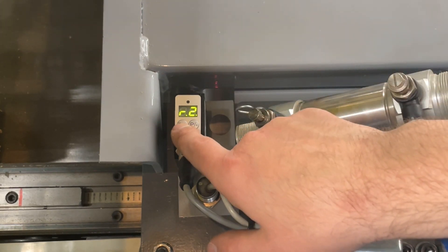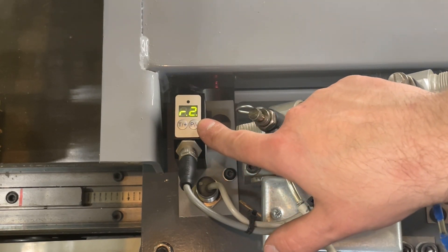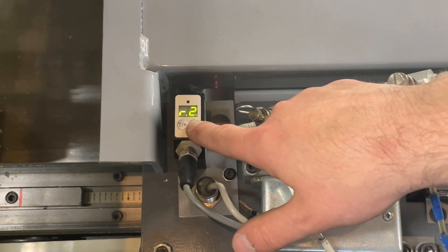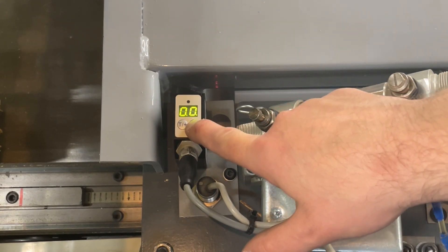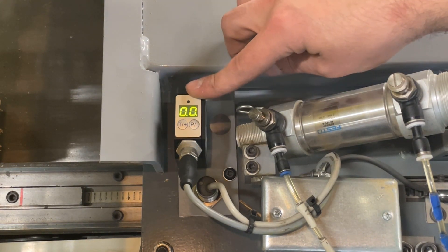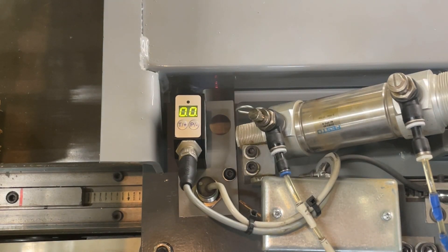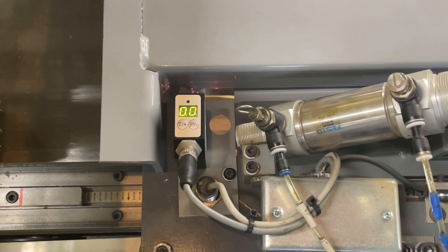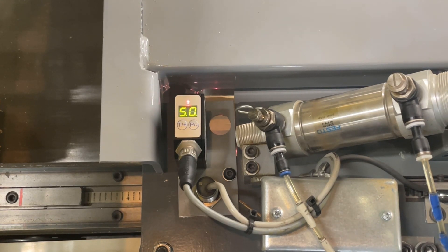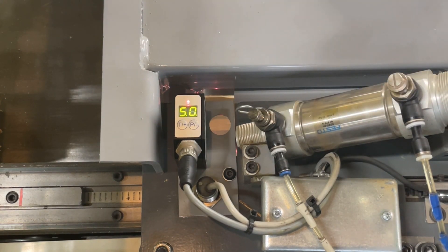To set the gain, press the T+ button until you've reached the R2 setting. This is the last setting, and after this you can hold the P- button to return to the main sensor screen. You can see that since we calibrated the null offset, the background reading is now zero, calibrated to the table background. Now let's try putting this crayon mark underneath it — and you can see that maxes out the sensor and the output light comes on, which lets our PLC know there's a crayon mark underneath the sensor.